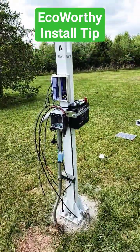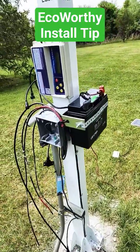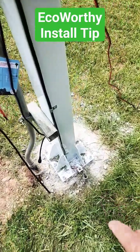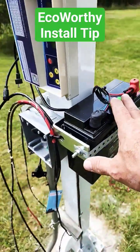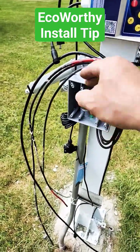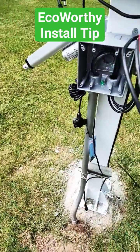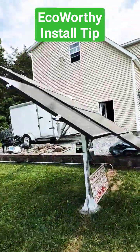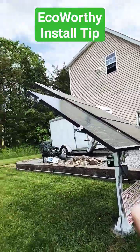On the second one, you obviously learn your lesson. I highly recommend that you run your grounds, do your ground rod, put your battery up, run your photovoltaic PV array, get your wires ready. Get this base set up first before you start putting on the canopy and working underneath that.